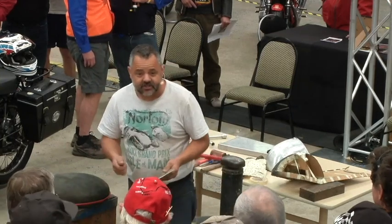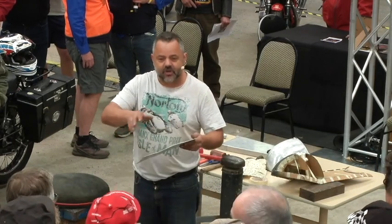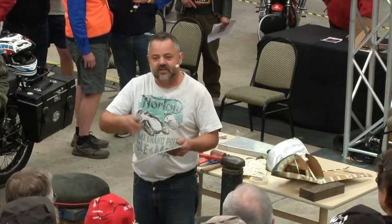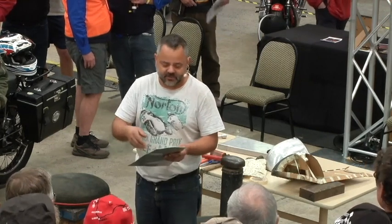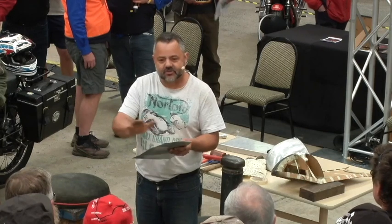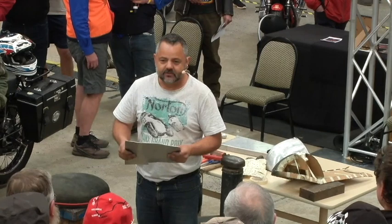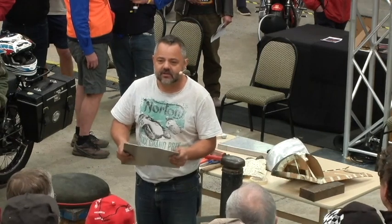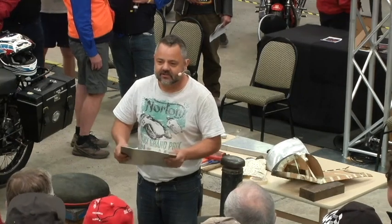Okay, you get the oxy, okay, and then I'll get a carburizing flame. Put the soot all over the top, okay? Then make it a neutral flame. You can even use a hot air gun if you don't want to waste your money on the oxy, and just warm it up until the soot's gone, and then quench it, and it's annealed. And you quench it just with water? Yeah. Do you have to quench it? Or no, you can let it sit, but I'm in a hurry. So.